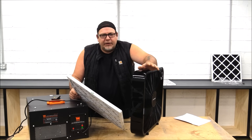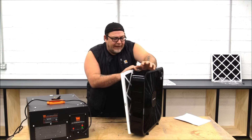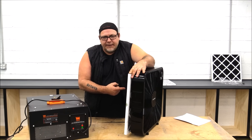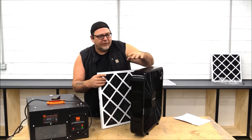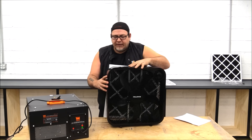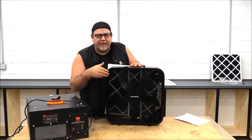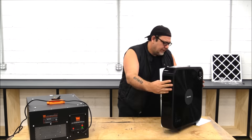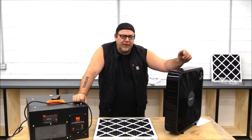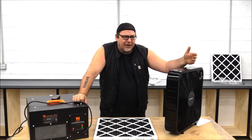If I wanted to get fancy with a box fan setup, I could, but honestly one charcoal filter at MERV 8 and another at MERV 11 popped on there will give me the same quality filtration as the traditional unit for way less money. You can duct tape the filters on if you want to. I've seen guys make really fancy systems, and some cut out the back where the motor is — but you don't really need to do that. Because of the way the box fan is designed, the fan blade leaves air gaps in each corner, so it pulls enough air behind the fan to keep the motor cool. You don't have to worry about overheating. As far as longevity goes, I have a friend who had four box fans with filters and a pre-filter mesh in his spray booth for the last 10 years, and not one of the fans has broken down.